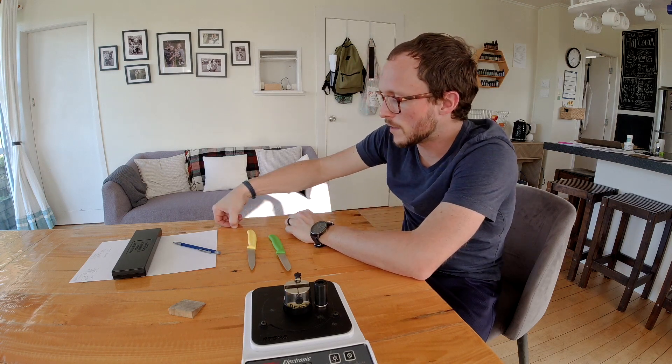I contrast these numbers — where you're up around the 200s and then drop to around 150 — with a previous test where I had one around 210, hit it once on denim with Mother's Mag polish, and it dropped all the way down to 108, which then stropped on kangaroo all the way down to 95. Just two steps. Denim is good for initial deburring of the larger burr, but it seems best to follow up with something else.